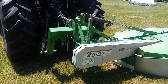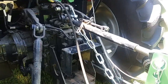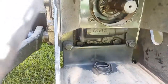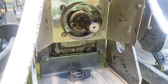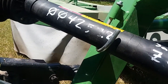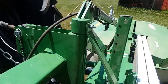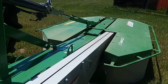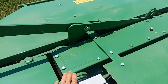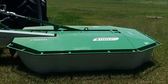Let's talk about the power source and work from the tractor back to the mower. These mowers have blades that have to turn, and the power source for those blades is coming from right there — that is called the power takeoff shaft. That shaft runs right back to the mower to provide the continual power source to spin the blades. You can see it coming in right here, going back to a set of belts, and those belts run over to a gearbox found up here, which then transfers into the drums underneath the mower.